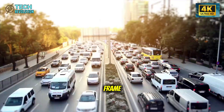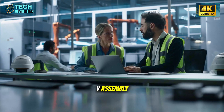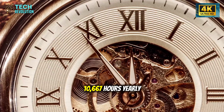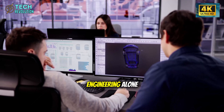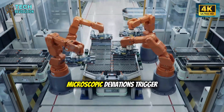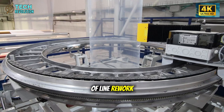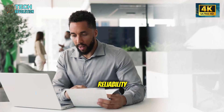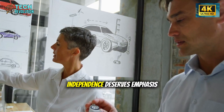The battery installation system operates with just 0.7 millimeters of tolerance. Three robotic arms lift the narrow battery module in perfect synchronization, bolting it directly to the gigacast frame without any manual adjustment needed. This cuts installation time by five minutes per vehicle compared to Model Y assembly. Multiply that by 128,000 annual units and you've saved 10,667 hours yearly — 444 full production days regained through precision engineering alone. Quality control runs through automated cameras and sensors checking every component in real time; microscopic deviations trigger immediate adjustment or part separation, eliminating costly end-of-line rework and ensuring consistent quality for buyers who prioritize reliability.